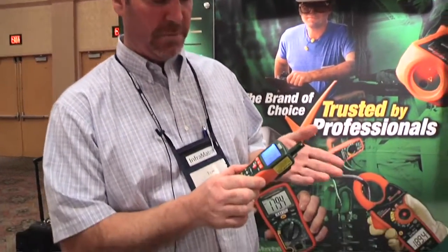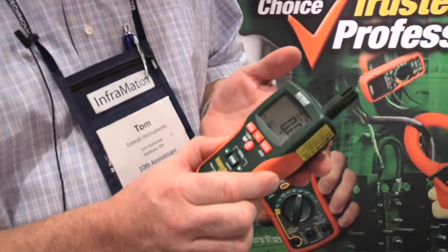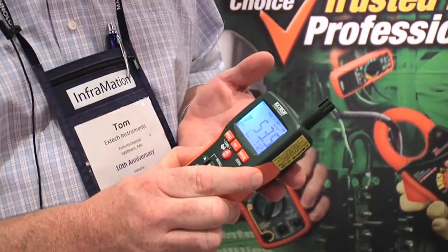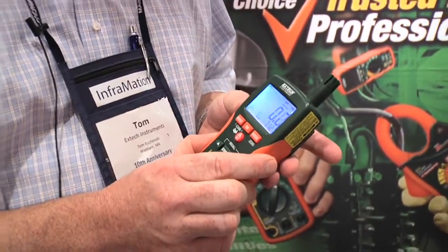It is a 4-in-1 meter, so it will do non-invasive readings up to 3/4 of an inch below the surface. And you can use this meter for building materials, hardwood floors, plywood subfloors. Basically, any building material will give you a quick instant reading of moisture in that material, done non-invasively.